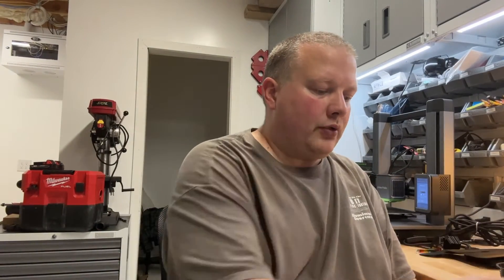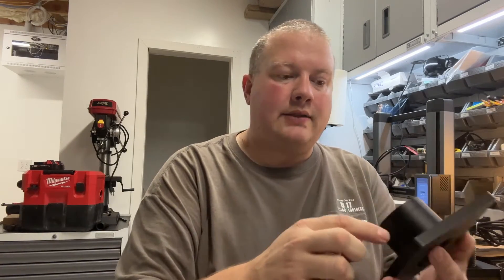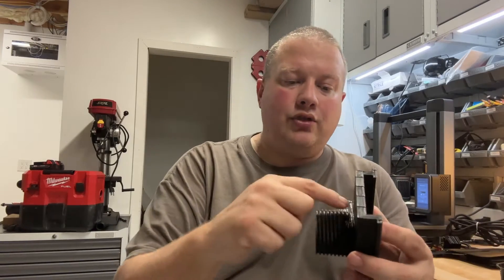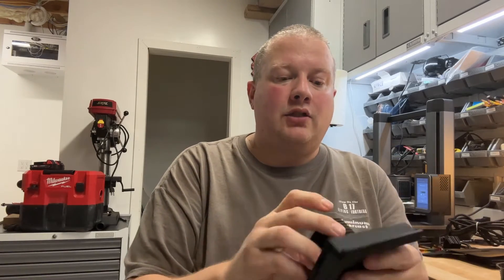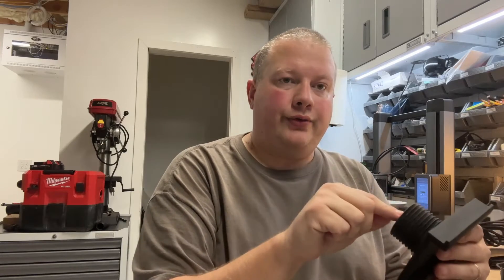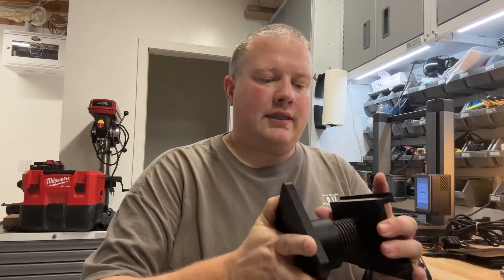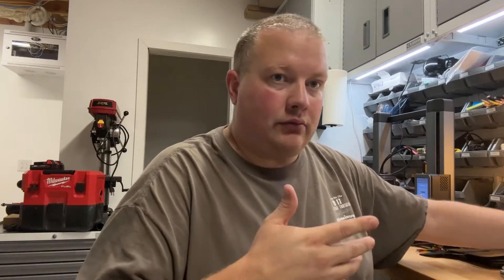It worked pretty well with one problem. On the VESA part, you've got an outer wall and inner wall with threads that add thickness and stiffness — no problem. On the wall-mount part, you just have one outer wall with 10% infill. So my plan is to put another hole through here to give me another outer wall which is thicker, add some stiffness, and increase the infill to 20 or 30%. I'll let you know how that works. I used Fusion 360 to design this. The threads work great — take a little to get them loosened up, but once they're loose, this works really great.